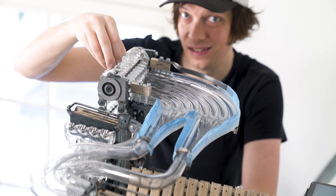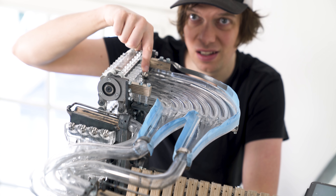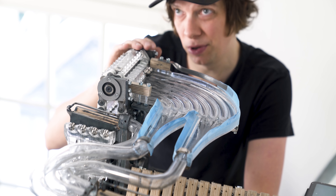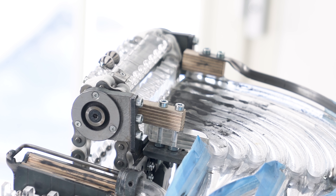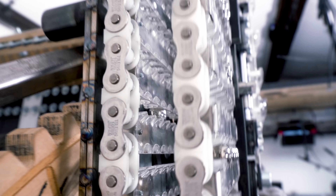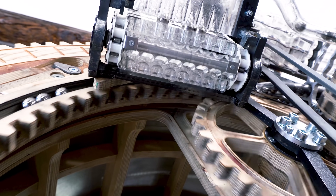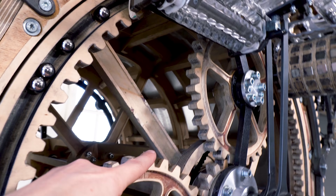The first and absolutely critical issue is that the conveyor belt is producing ghost marbles. I've seen instances where marbles get stuck here. These ghost marbles travel down the conveyor belt on the back side of the side row, get released underneath — super close to the gears — and they can go straight into the gears and break the whole Marble Machine X. In several marble tests I've suddenly found marbles on the floor with no clue where they came from.